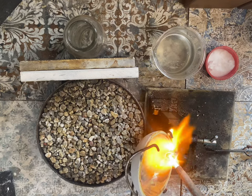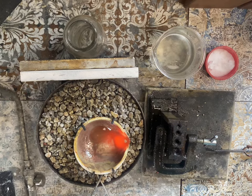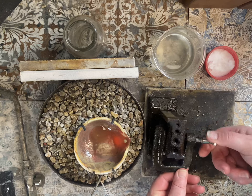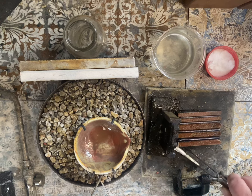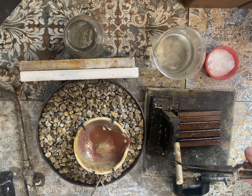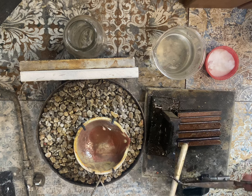After the 30 seconds, I then pour the silver into the mold. Now that the ingot is poured, I turn off my torch and open the ingot mold — just be careful, it can be really hot. Then I grab my tweezers and pull out the ingot. Look at that — she's done! This can be used to make bracelets, bangles, ring bands — you can roll it out to whatever you need.